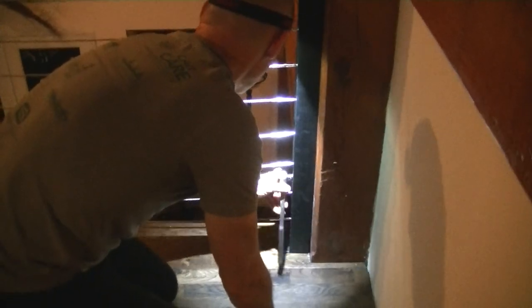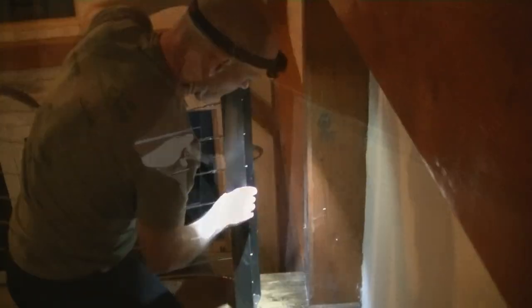So the last step after stringing all the cable is to loosen up this post from the beam, and then we tighten up all the slack in the turnbuckles. I've got split washers on the other side. They'll wrap, but I have to initially tighten them a little bit from the other side because the split washer won't grab until there's some tension on it.